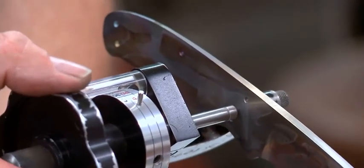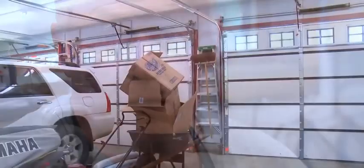It's right on 60. A lot of factory knives are 55. Custom knives are usually 60, 62. Some steels can go 62, but files are usually about 59 or 60, so this will not be cut by a file. It will skate right over it.